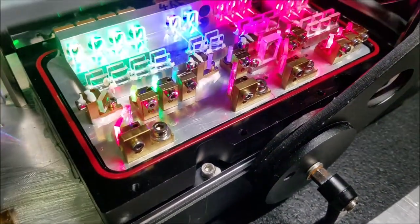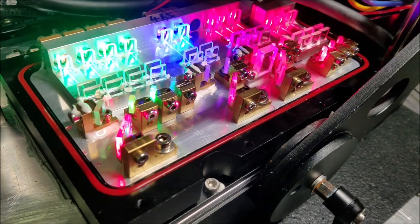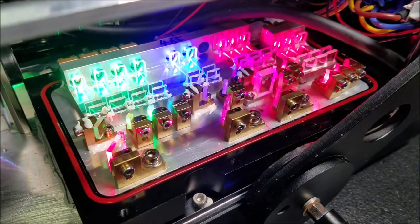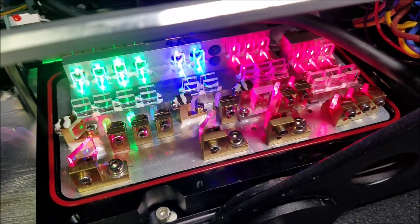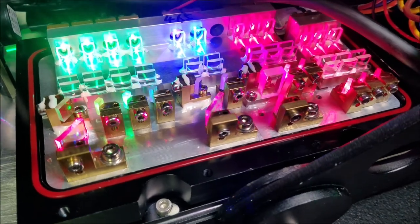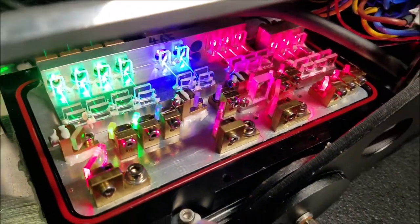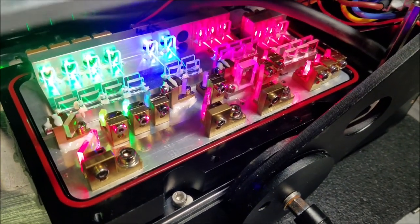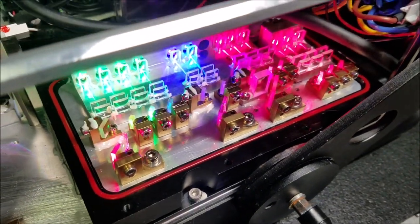Overall, you don't need to glue the optics down, the mounts down, because in higher end lasers they don't anyway, and they seem to be okay, which is surprising. So something we're kind of testing out to see whether or not that is crucial. On the upside, not gluing the mounts down does give us an upside, and that is if this comes back in for repair, the time it's going to take to repair the laser is going to be significantly reduced. So that's always good. Let's see, what else?